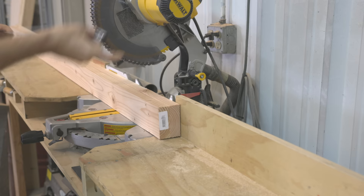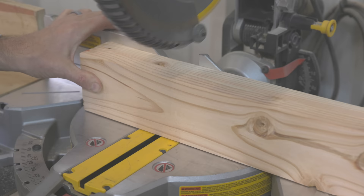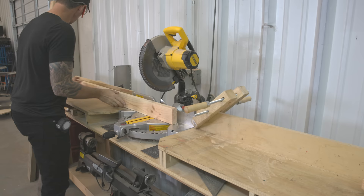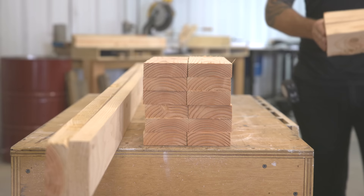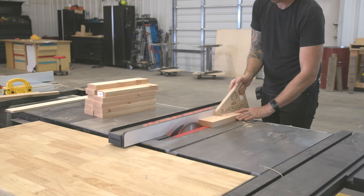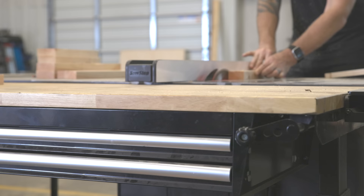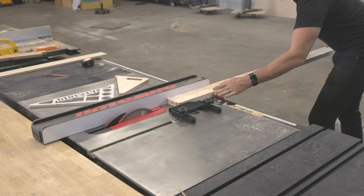I wanted to show you how you can build a castle joint bed using additive joinery versus having to use chisels and hand tools to build the legs and stretcher connections. Right now I'm cutting the pieces that will get sliced up and glued back together to create the legs, using a Rockler hand screw clamp as a stop block for repeatable cuts. I needed 16 strips cut to 15 inches and 8 strips cut to 11 inches — I'll show you how these fit together to become the legs in another step.